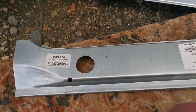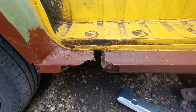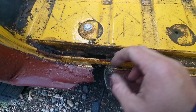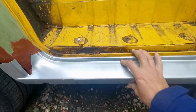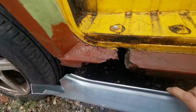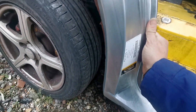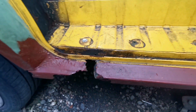Whenever welding, first thing to do is take the battery off. So literally we've got the inner sill, we've got to cut off most of the outer sill so we can measure up the inner sill. That's going to go inside, which will give us this piece back. So we've got to cut back, get that sorted, then we get covered by the inner sill. When both of those are in place, we're going to tidy up that wheel arch and join it up to the fresh metal. First job, we've got to get cutting this crap off.